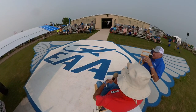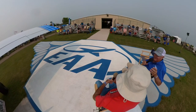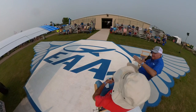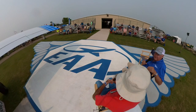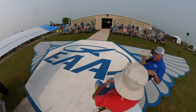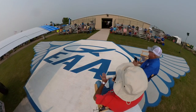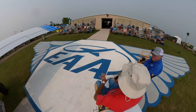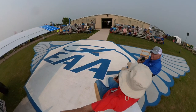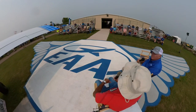That's a different progression in designs — we actually started with a four-place and moved down to a two-place. As far as I'm aware, the Model 5 is probably the only six-place amateur-built aircraft available — though there may be one other. One absolute fact is that the other one is an aluminum airplane, whereas all of Bob's designs have steel tube structures in the fuselage. For that backcountry flying, that's best — having a steel tube structure around you can be a lifesaver if you have an accident.